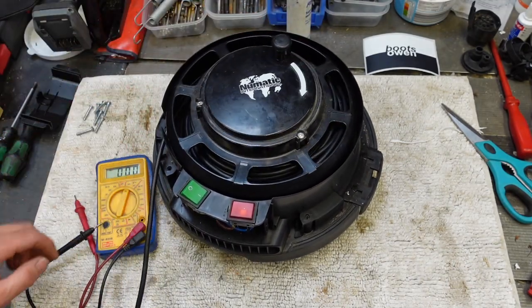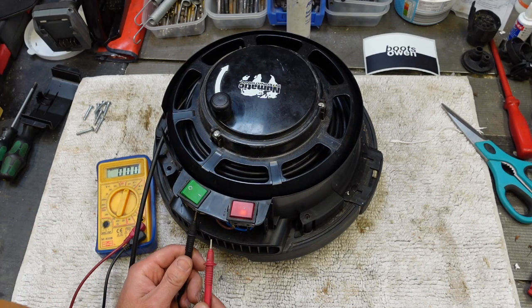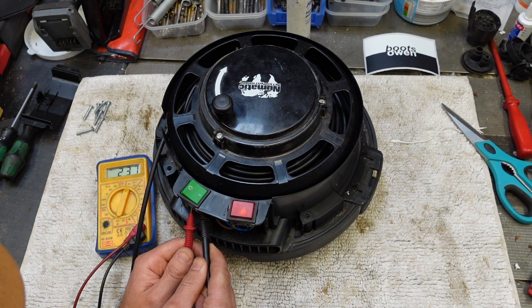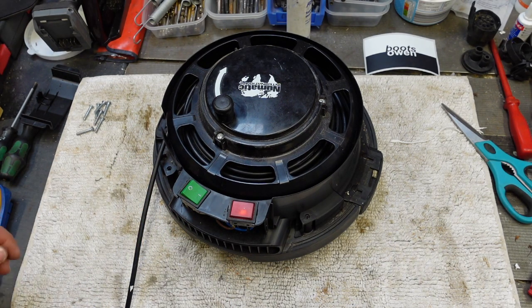So that's now live. And as you can see, the light's on. I'll try and touch these. Can you see that multimeter? So the switch is on. There's a voltage coming through to the motor. So is the motor burnt out? Well, let's see. If I take that off, those contacts in there are live and I'll switch them off. And now they're not live.